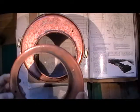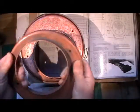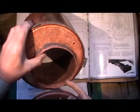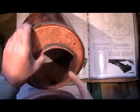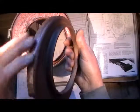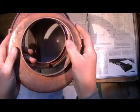Okay, so in my last video I showed you me making these compound flanges on my backhead and my throat plate. As you can see, I've just got this one temporarily fitted into the outer firebox, ready just to finish this joint off to get my dimensions, and I have still got to take a light skim across these diameters just to make it all nice and smooth, ready to fit in the relative parts of the boiler. So that'll be a job in the pipeline for the future just at the moment.